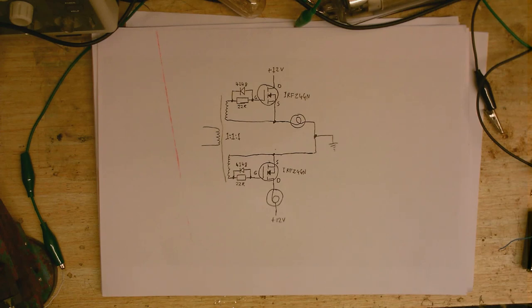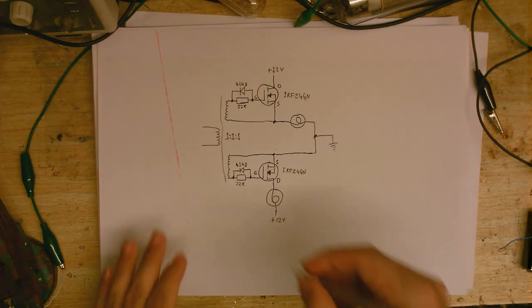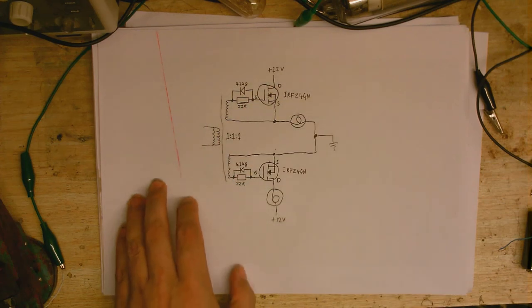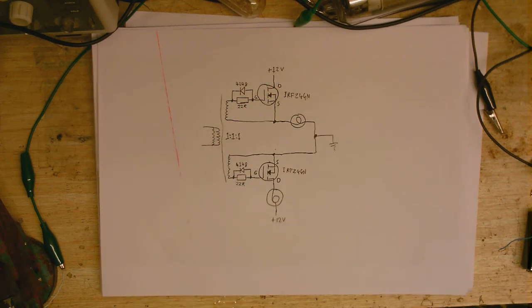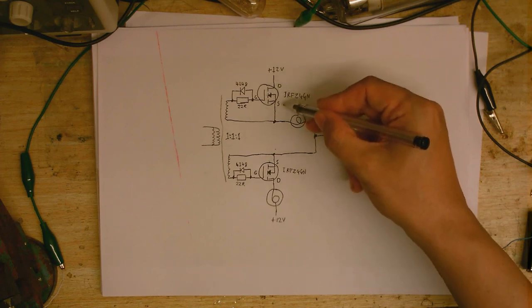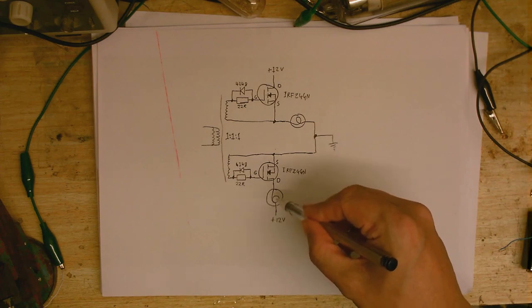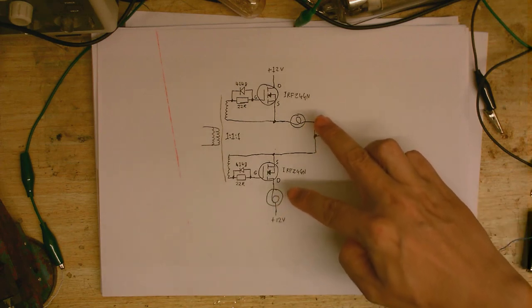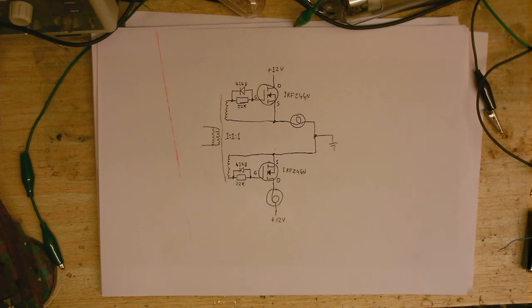So this is what I want to try — we've got a gate drive transformer now and you can see how the MOSFETs are connected. One thing I should mention: remember I said there are four windings on that gate drive transformer? Well, two of those windings are in parallel — it just works a little better that way. As you can see, we've got two light bulbs in the circuit. One light bulb is connected between the upper MOSFET's source and ground, and this light bulb is connected between the lower MOSFET's drain and the plus 12 volts. I want to see both of these light bulbs coming on at the same brightness. I'm a little skeptical as to whether this circuit's going to work, but let's give it a try.